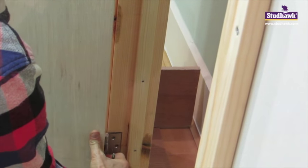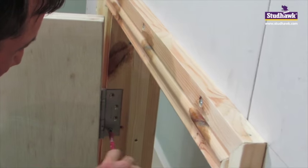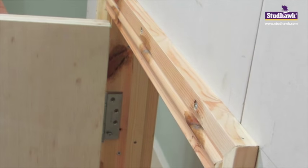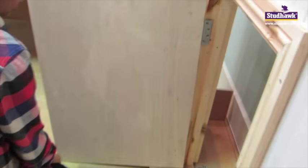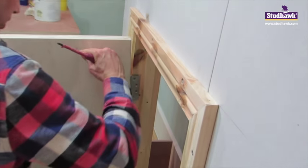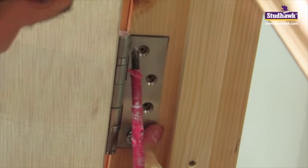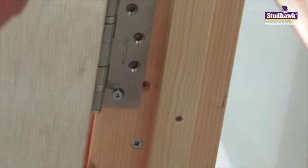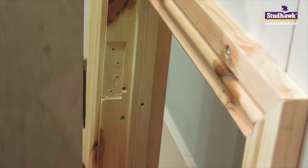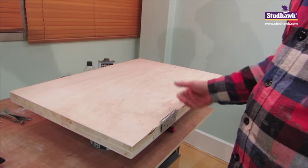Holding the door with your left hand — what you'll find is when you start to take this one out, you're hanging on one screw. When your hinge is partly out, your screw's partly out, take the hinge out like that and sit your door on the far bottom corner. That's also true when you re-hang the door: put it on a diagonal so that you get the hinge up. To get this screw in, drop the hinge into place on that screw and screw it up tight. Don't put your hinge in place and do the other screw first.